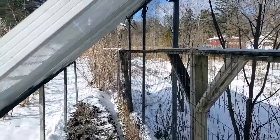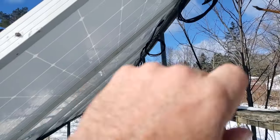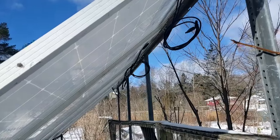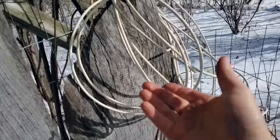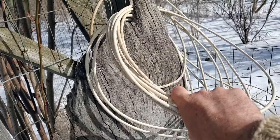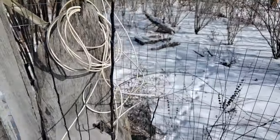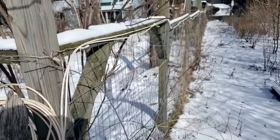These five 340 watt panels will be connected in series — you can see this is distinctly a work in progress, they've not been wired together yet. There'll be a 20 amp fuse on the positive line coming out, and they will then be connected to this 10 AWG wire, which can carry quite a bit more than 10 amps worth of energy. I got tons of this stuff for free from an electrician, a few hundred feet at a time on spools — he was willing to trade for plants at some point in the future.